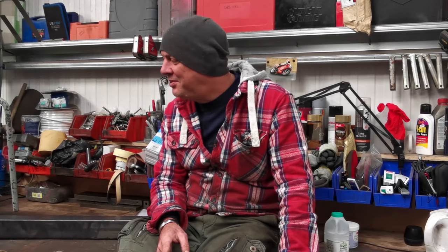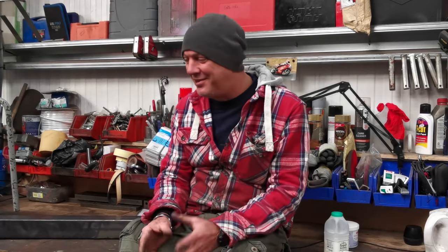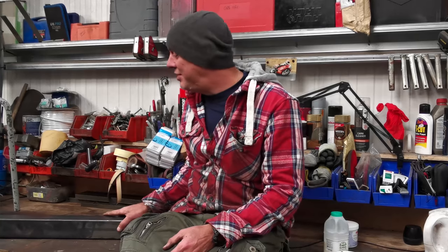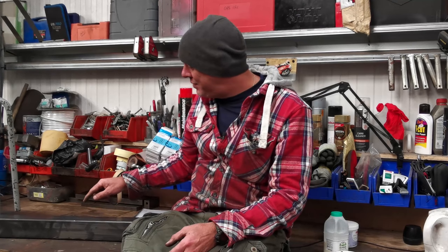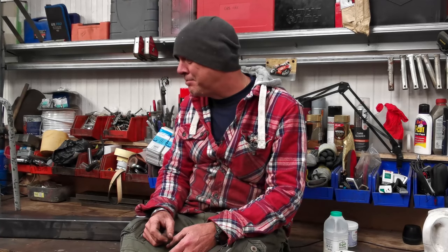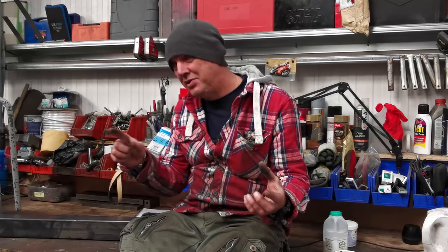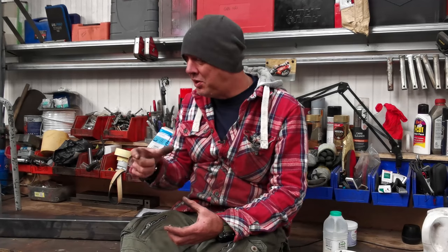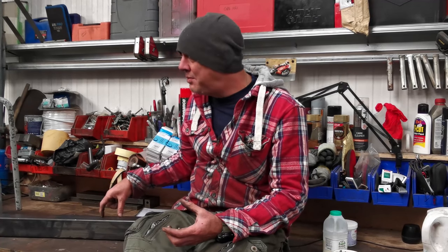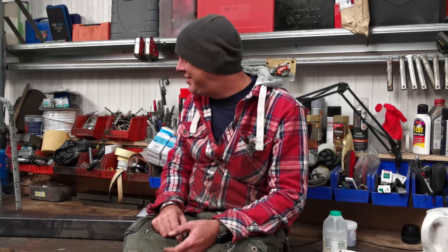And you look at some of the videos of people making frames and you just think, oh, mate, you're doing it all wrong. Everything's moving about. And it shouldn't be. It's got to be a pretty good and stiff and solid jig. So this stuff is mild steel, 80 by 80 with a 3mm wall thickness. So this is sturdy stuff. And the idea is it's all going to be based off two frame rails that you can see at the bottom. And between them, I'll just cut another section. I'm going to weld that in between, front and back, and it'll all be dead level and true. Because the sides on my table is cock on as well.